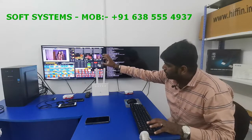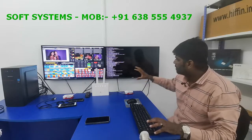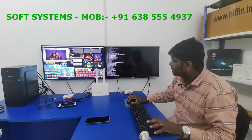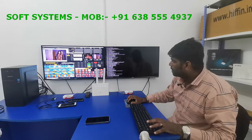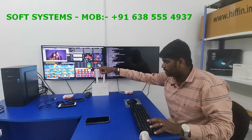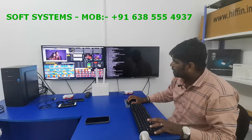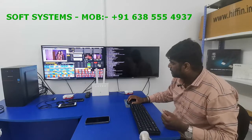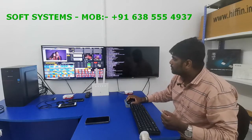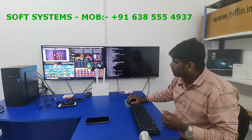We are going to show how this video comes through the router — that means the local network — to my decoder and displays the signal on the TV. I go here to streaming and put in the local IP address. This decoder and my computer are both connected to the same router, so both are on the same network. The GoLive software has two profiles: one for streaming to YouTube normally, and a second for a custom RTMP link. That custom RTMP link is provided by my decoder via the local IP. I simply enter that local IP address and stream key, then apply.